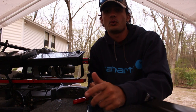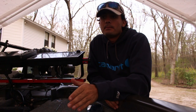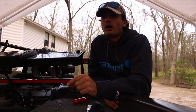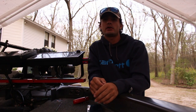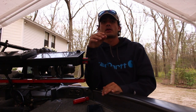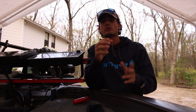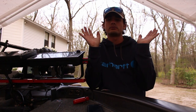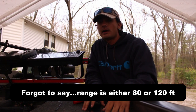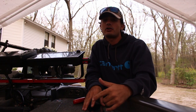Now for my Mega 360 settings — to me it's actually a lot easier to use. I pretty much never change my settings on my 360. I've got it in the forward view, so instead of the true 360 view around the boat, I have it set to the front 180 or so, since I'm always fishing at the front of the boat and positioning downwind of where I want to fish. I've got color palette 4, sensitivity between 15 and 16, contrast on 10, and dynamic contrast on.